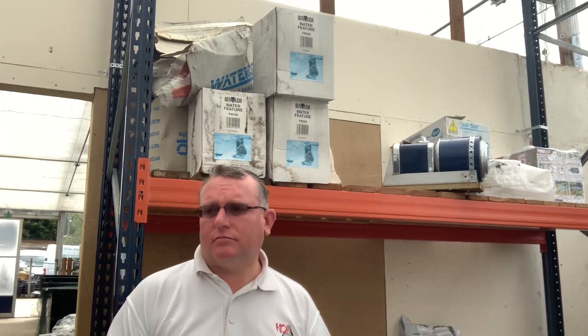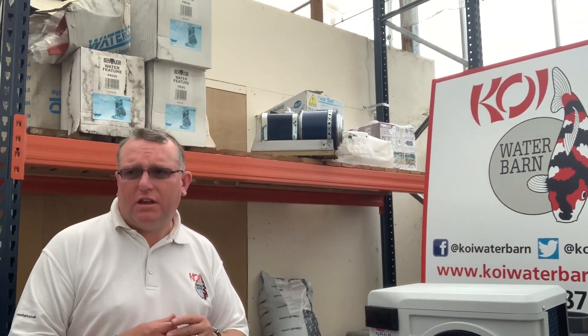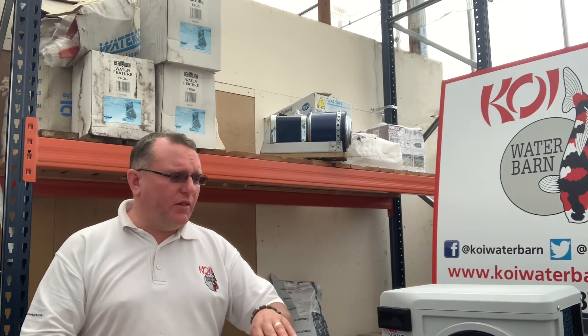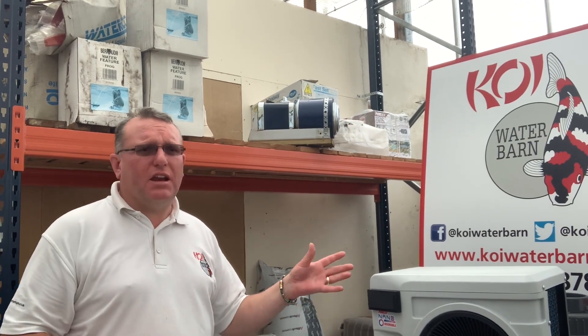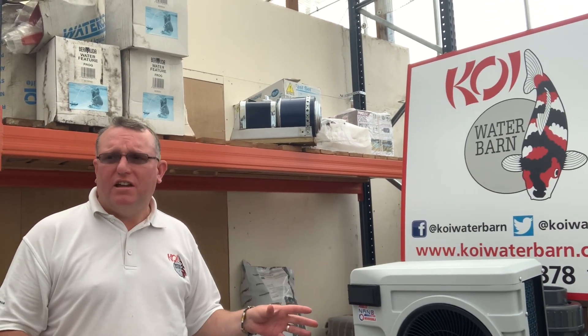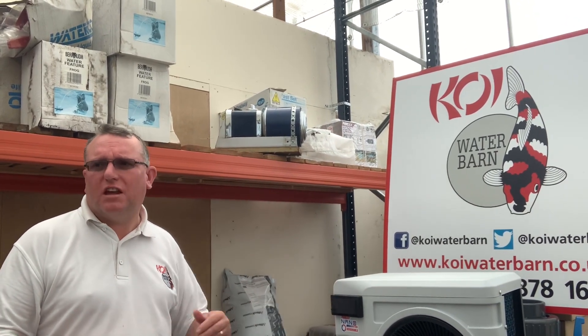At the moment on my one, I've fitted up an Electro, but when I looked at my electric it was on seven kilowatts. This is 600 watts — which is a lot of money compared. That there is 600 watts for a maximum output of three kilowatts. Obviously the output is governed by the input air temperature, so the colder it gets, the less output you'll get. But typically, at above eight to ten degrees air temperature, that 600 watt coefficient will give you the full three kilowatts.